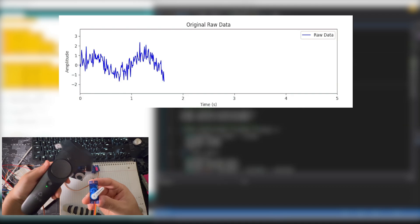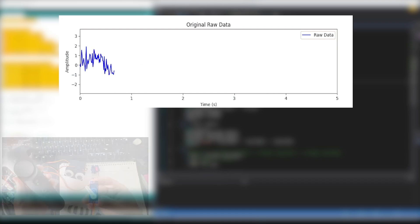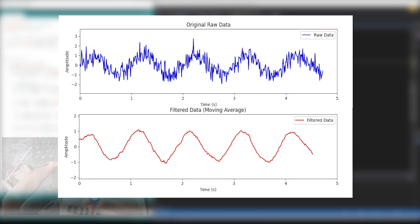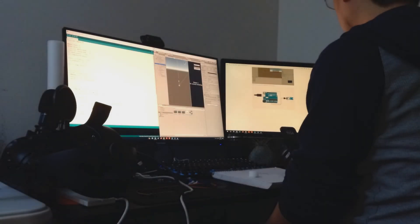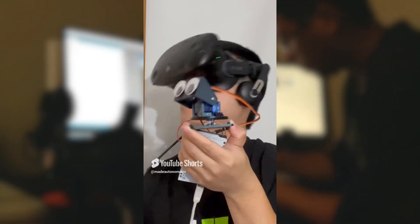Another important aspect is filtering our angle data. When it comes to programming robots and sensors, it is crucial to have clean data. The top of the plot represents our controller input — you can see it is quite noisy and jittery. Now look what happens when I apply a moving average filter: it's a lot cleaner and smoother. That concludes this section. Now we just have to program the rest of the servos, and remember to always test all your servos in your code at each step of the way.